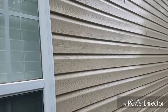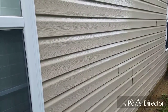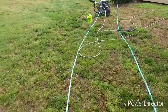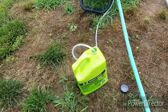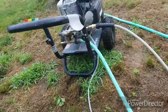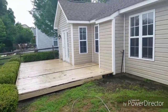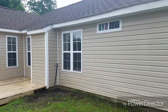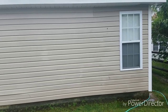I've been using my nozzle. I hadn't even used the backpack sprayer. I've just used that injection stuff or whatever. Just dropping my hose right down in the bottle of this house wash. Put a little Dawn in there, mix it up and drop that hose in. It just sucks it right in. I hadn't even used my backpack sprayer over there. Just been using that pink tip for the higher spots, and that black tip, and it's just putting a chemical right on the side. So I think you can see that.